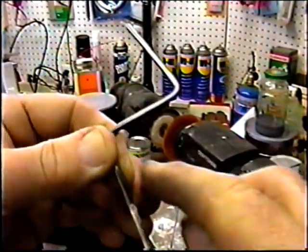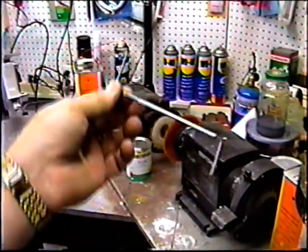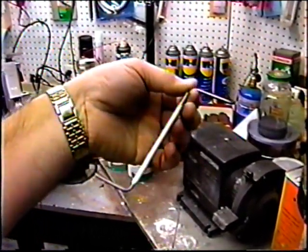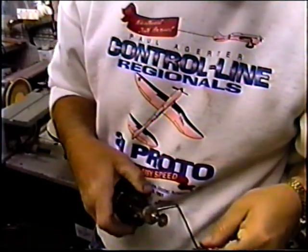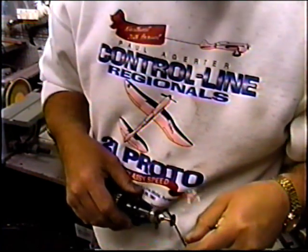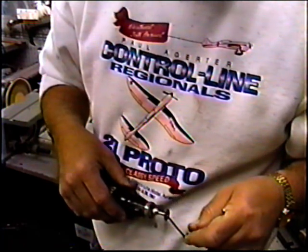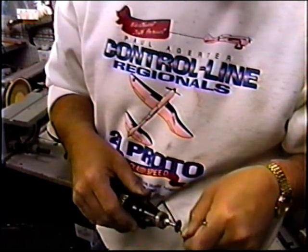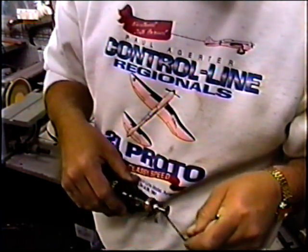Any material around any of the corners, but these flats, that I think is about the limit we can take material off of there, and we're ready to make the mold up. Also, where the epoxy is going to go, I want to just roughen this up just the slightest little bit with the end of a parting wheel. So just let the epoxy get a better grip and act as a torsion agent. Add some torsional strength without making a part any heavier at all.